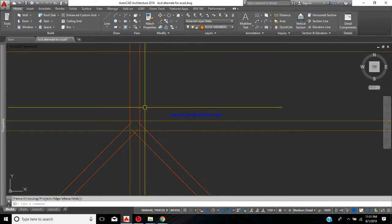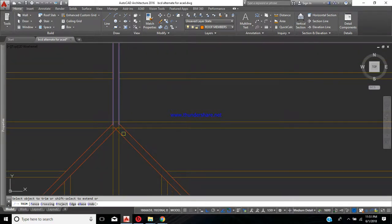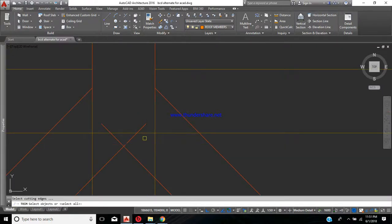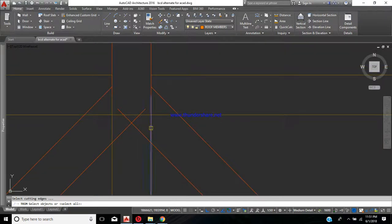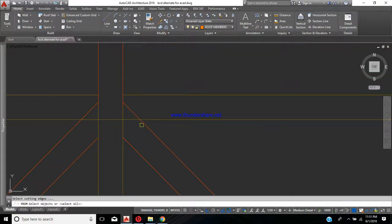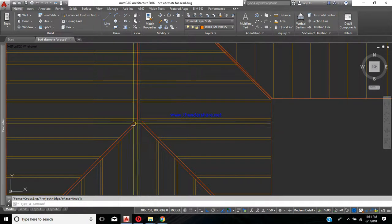What would be happening here is the same operation. You would want to trim out wherever rafters cross the ridge, moving backwards, and then let's take this one out. Nothing crosses the ridge. All right. Let's terminate. Let's take that piece out, so we can get at this. And let's also stop this piece. And that is what happens at the termination there.